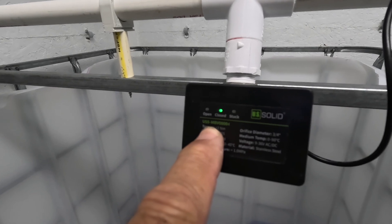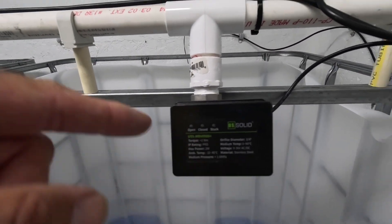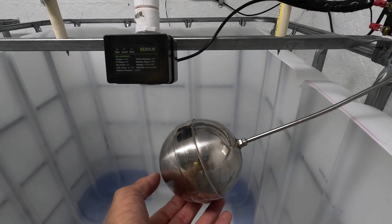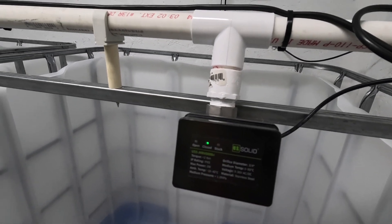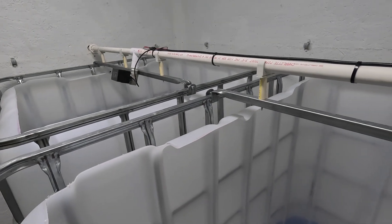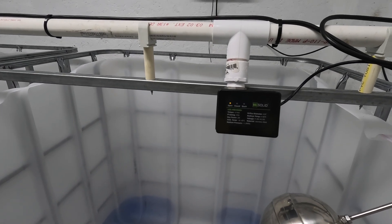You see that green light on this valve? That's telling me this valve is closed, so when incoming sap comes in, it's not going to get past this valve — it's going to run right on over. That light's not on on this one, meaning this valve is open, so it's going to start dumping into this tank. When the sap level rises and catches the float — hear that? The valves are cycling. This tank is full, so we switch and run to the other tank. See that green light come on there? That means this valve is closed, and now that valve is open. When this tank gets full, it automatically switches and starts filling the second tank.